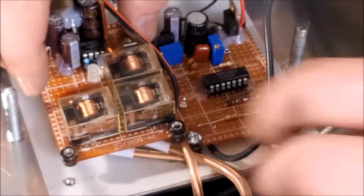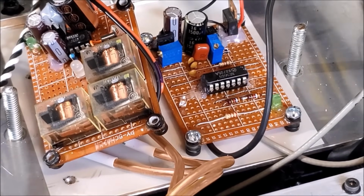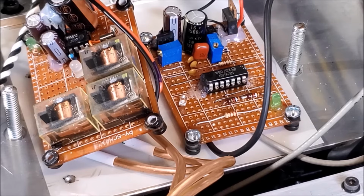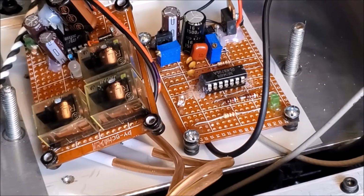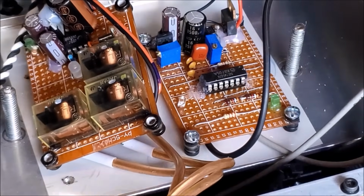All right. Set that off to the side without shorting anything. Okay. Good. Just to make sure, take the tape off of the front of the laser modules just in case they fire for an unknown reason. We don't want the tape burning and destroying the output windows. Okay. I'll flip off the light, plug in the laser. Sanity check. Looks good.